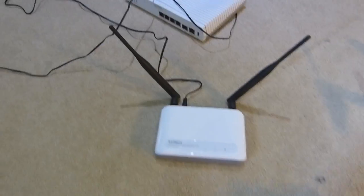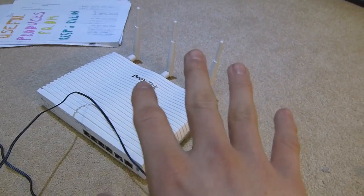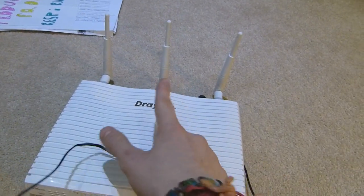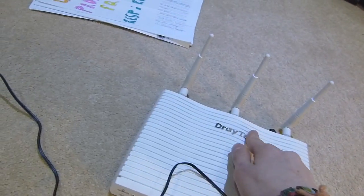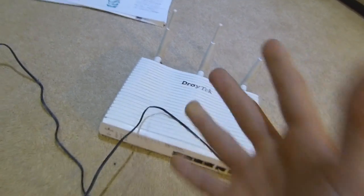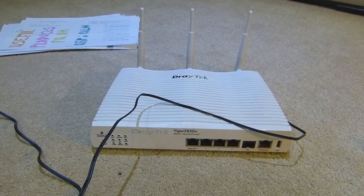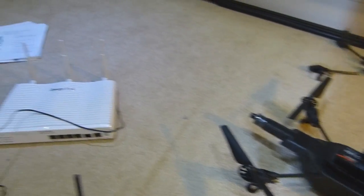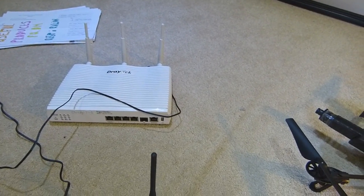I'm going to explain why this is the best option. The protocol that standard wireless repeaters use works like this: one antenna picks up the signal from the drone, and then the two antennas on either side send it off to your device. But the SSID is a big factor — if you have the same SSID as the drone, which most repeaters don't let you change, you're going to start running into a few problems.